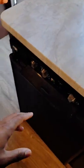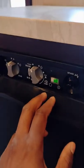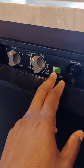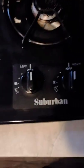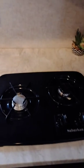With that being said, you are able to go ahead and light your refrigerator. There's an indicator on it and we have the step-by-steps on how to get it started, but just in case it goes back out, the steps are there. This line should go to the green to indicate that it's on. For the gas stove, make sure after use you cut these to the off position, or you will trip the carbon monoxide gas indicator and it'll go off. So make sure you have it closed.